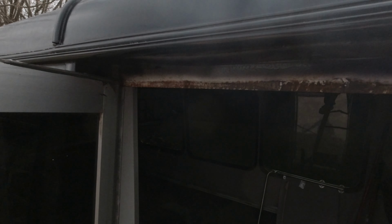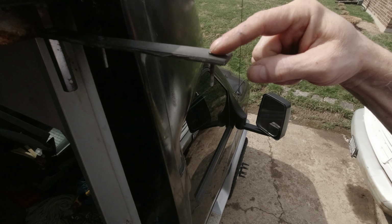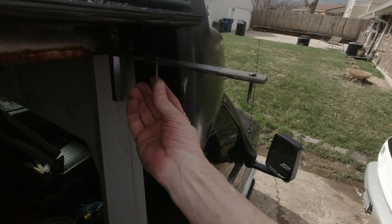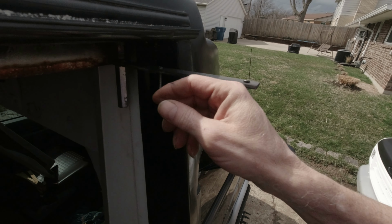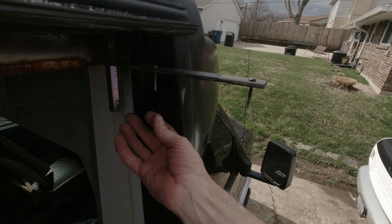All the mechanism up inside is all working correctly, but in order to get that door off, like I say, you had to pop it out of the bottom down there and then come up here and remove these 2 screws, which this screw was very easy. This screw I had to use a short bit with a 1/4-inch wrench and just barely turn that little by little until I dropped the door down, because you can't raise this screw up because of the distance here, but as you unscrew it, the door just drops down and eventually drops right off of it.